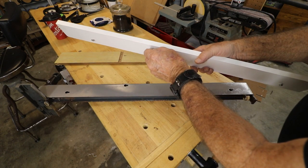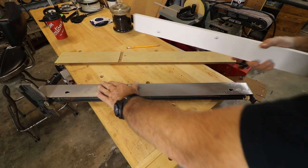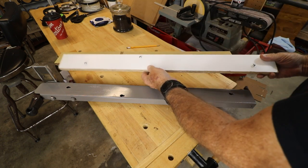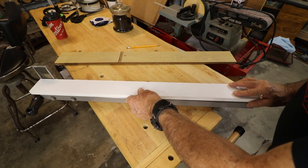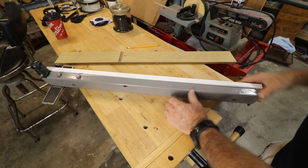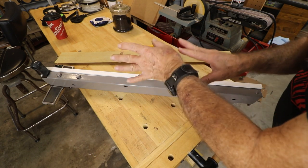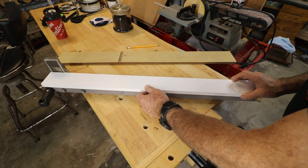Do the left side then the right side, or right then left — it doesn't really matter. You'll end up with a pattern of screws. When you tighten the screws down, leave a little gap between the screw head and the lumber because you want it to slide into the slot snugly. Looking at the screw positions, I can tell this piece goes on this side of the fence — slot it forward and it's locked tight.